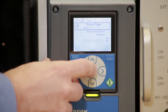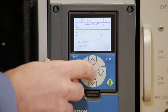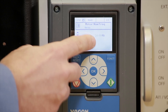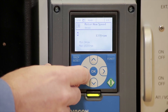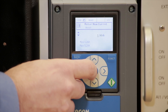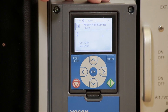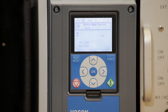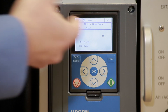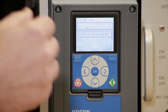We're going to use an induction motor, so we'll skip through that. The voltage — please look at the motor nameplate, most of the information will be on there. In our case, we have a 230-volt motor. We're going to change from 50 to 60 Hz. Next is the motor nominal speed — whatever the RPM on your motor nameplate is, enter it here. The ampacity of the motor: if it's a submersible pump motor, the service factor amps should be entered here instead of the full load amps, only if you know the pump motor will go into service factor. In our case, we're going to put a motor FLA of 1.9. Next is the power factor, and then the drive states.